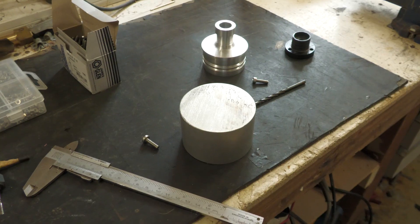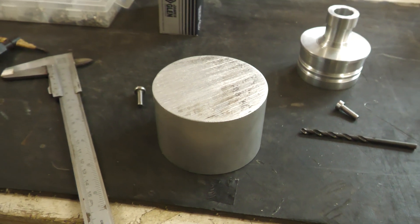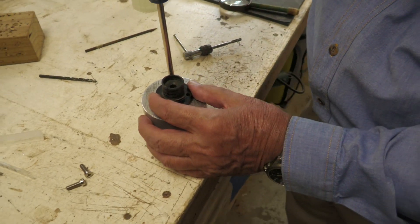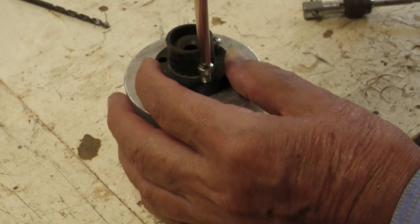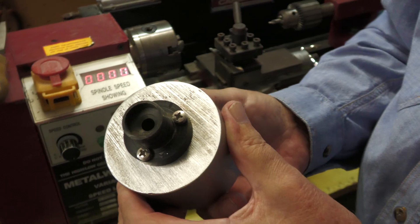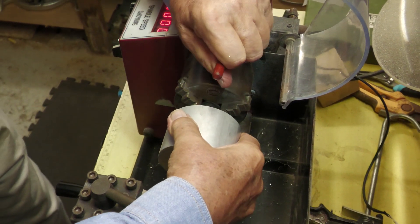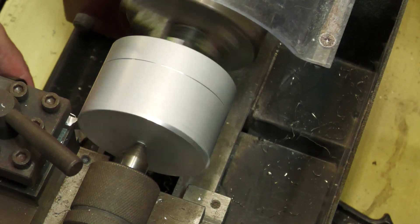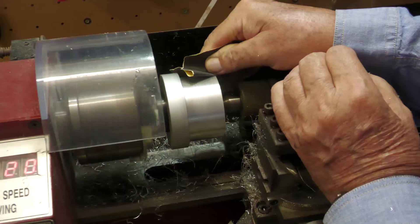Now we need to make a simple retaining ring for the outside of the nozzle — at least it would be simple if our lathe were big enough. Our chuck is too small to hold 76mm diameter aluminium stock, so the only way to grip it is to screw on an adapter. We already had an adapter but needed to enlarge the holes for bigger screws, and then had to machine those screws down to make them fit. Once the adapter was attached, we mounted it in the chuck and the cross slide barely fit, but we were able to machine it down to the right diameter.